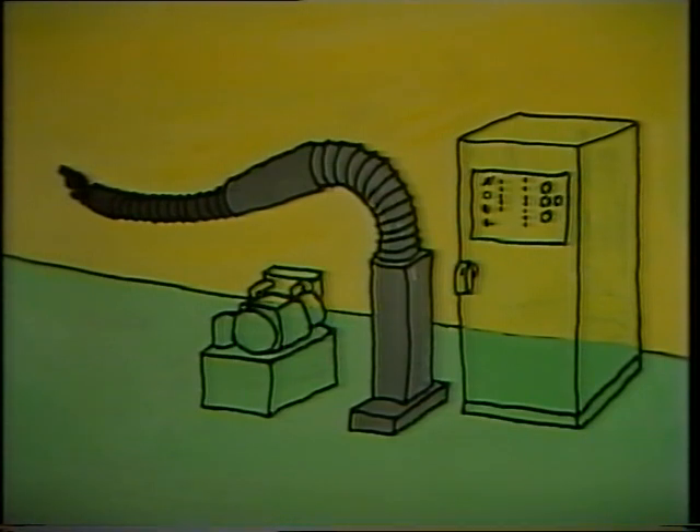The seventh axis is unique: the ability to roll its elbow in all directions. The shape and sophisticated mobility of the spine robot make it ideal for all types of spray painting jobs that require a robot that can reach inaccessible spots. The robot takes up little floor space and is easily installed in any existing spray booth.